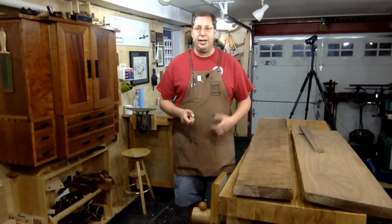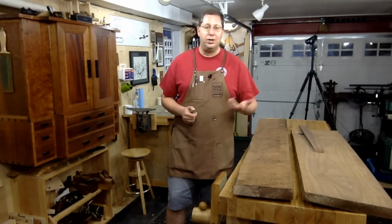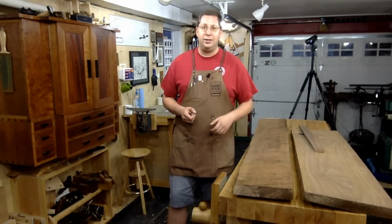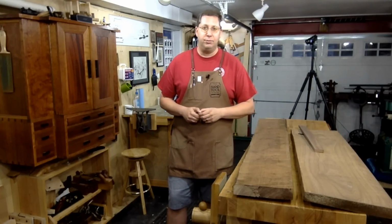When you're starting out, you've got a couple of saws, there's no reason to get super, super fancy here. Get a rip saw, don't put any rake on it at all. If you want, put a couple degrees of rake on it. No Fleam at all. Crosscut saw, do a standard 20 degrees, maybe 25 degrees of rake and Fleam on that.